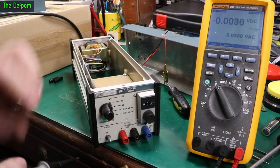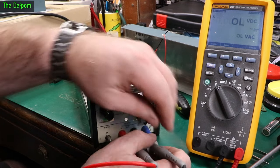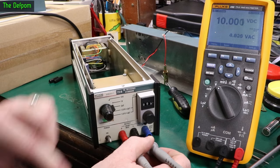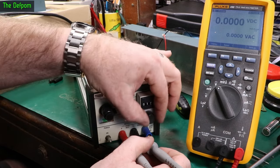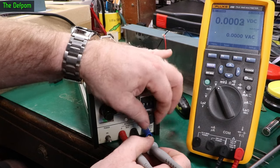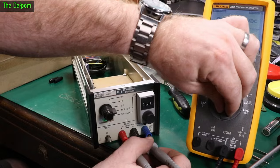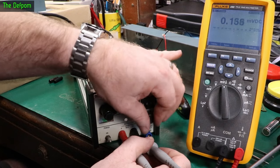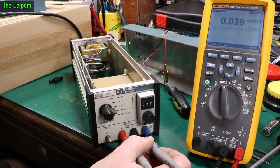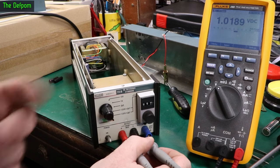We're on — let's do 10 volts first and check these outputs. Bang on 10 volts. 1 volt — yep, 1 volt's good. The delta — which is this thing — that's microvolts. 300 microvolts — yep, that's showing up. Not quite zeroing — still got something sitting there. Let's do 1.018 — yep, that's there. And 1.019 — that's there too. So the output's all working — that's great.